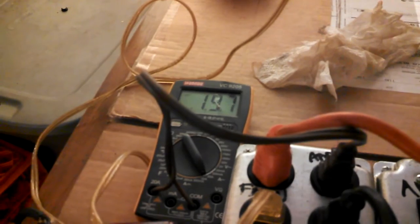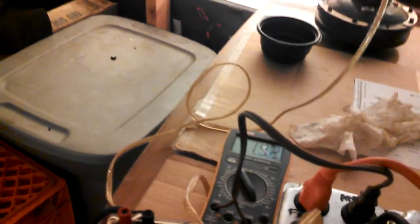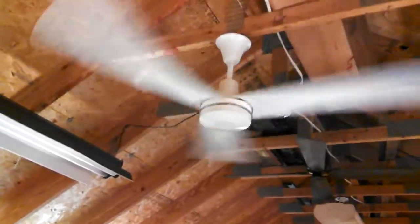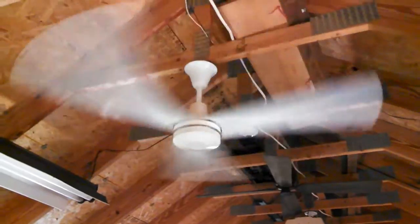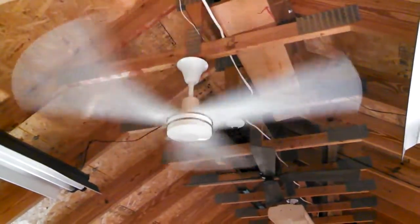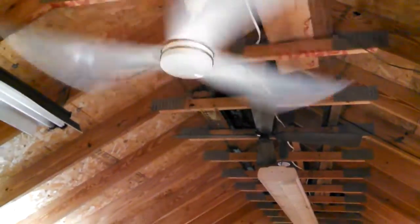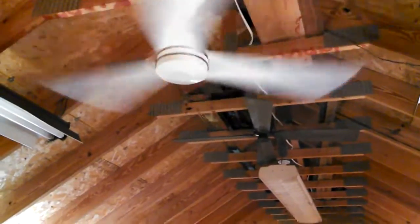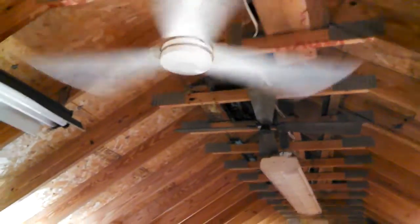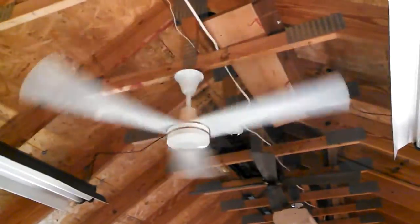Let's do zero to high for both of them together. Still normal — up to 2 amps, and I bet it'll drop as this gets up to speed. The last thing I'm going to do is check the cap value in both of them, and I'm going to take this one down first when I do that. I may or may not film it, so if they're not the same I'll mention it somewhere. Thanks for watching.